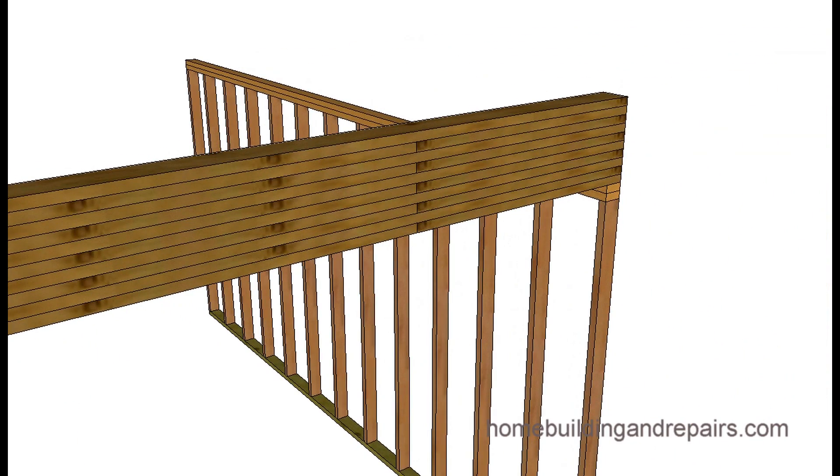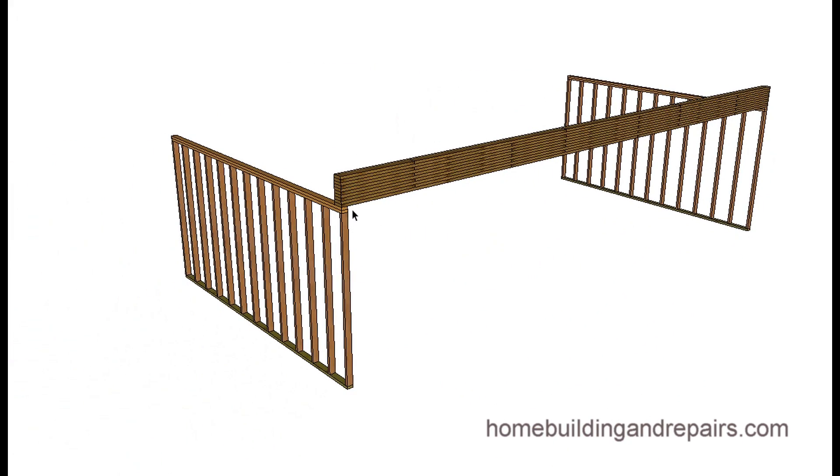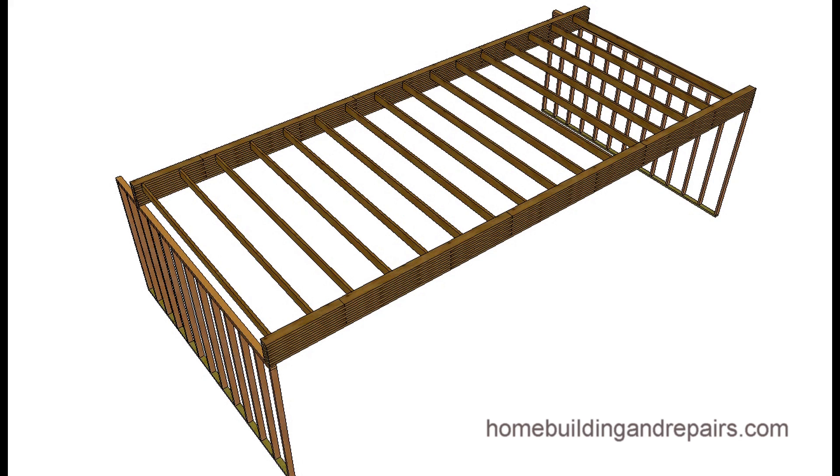You might actually suggest that the engineer drills the hole himself or herself. A glulam beam usually sits at the end of two walls with a bearing point at each end. The information I'm going to provide will not work for a cantilever — they do not want you drilling holes in the cantilevered section of a glulam beam.